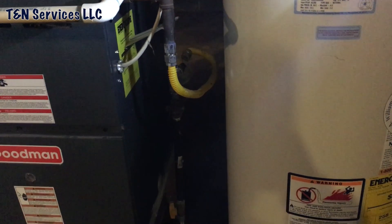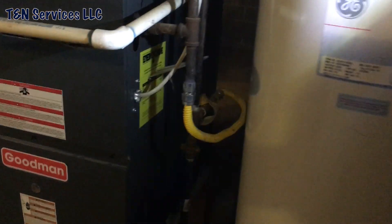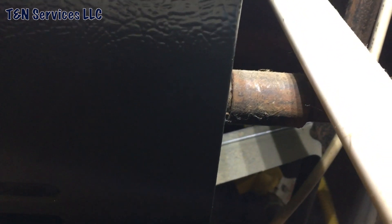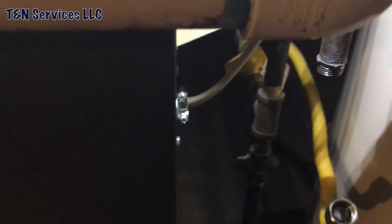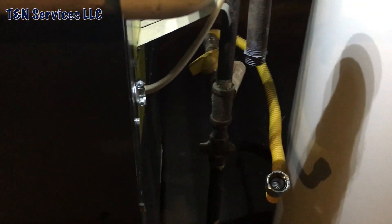It's funny some of the things you see. As I was taking the gas line apart to fix it, I noticed that instead of a coupling they have a little thread saver there. I'll go ahead and take that off — maybe I won't have to put a coupling. Actually I will need to put a coupling so I can extend it out past the PVC, then I'll fix it all up.